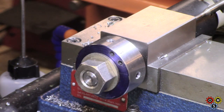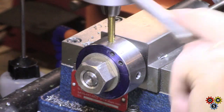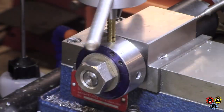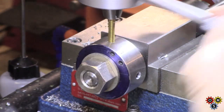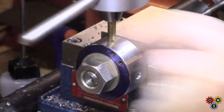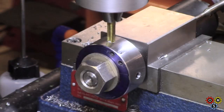Oops, sorry, I keep kicking the tripod. Right, first hole, tapping. Sorry, my arm's going to get in the way, I think, here. I've got a Sharpie mark on the tap, which you might see, because I can only go down about as far as my drill. And I've set this, somebody mentioned about running the machine, I think Randy said about running the machine hard with this in. All these holes are finished by hand.